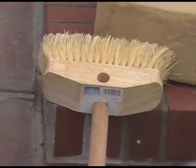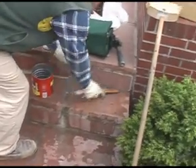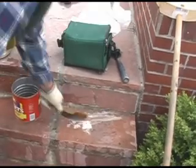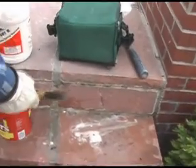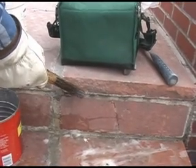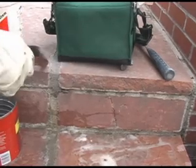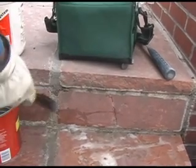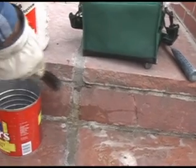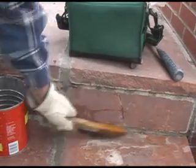Make sure you use rubber gloves because all of this stuff is highly toxic. Now, there are two things from this job we want to point out — they didn't do a little overhang here. What I would do is instead of coming flush, I would have this overhang an inch and a half to two inches, so the water running down here will just drip down and not run down the face and begin staining it. There's too much water running there.